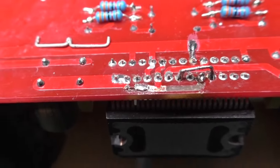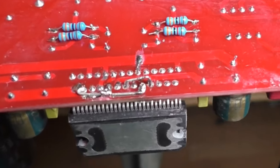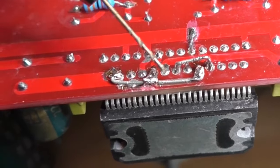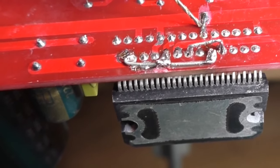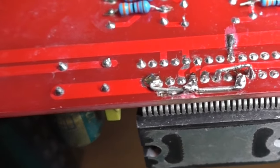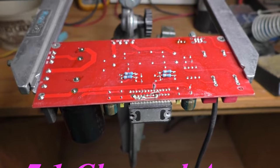You know, I can't do the replacement on camera because this is close-up work, and we'll show you what it looks like after I get it in there. Here is my PC board repairs. We've got my jumper in place connecting the 3 points here. There was also this one on this side that was fried. We'll be adding a fuse in this circuit to prevent that from ever happening again. But this board is repaired, and now I'm going to have to test it, and then I've got 2 more boards to fix.